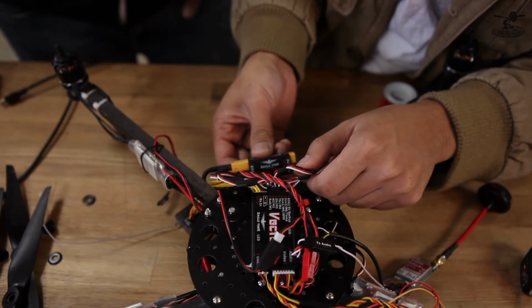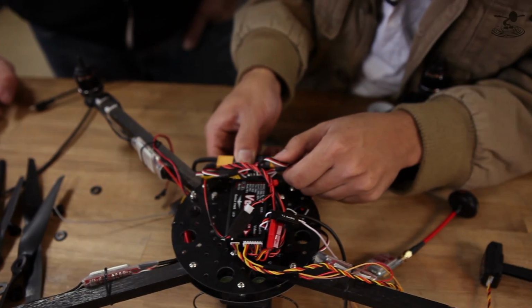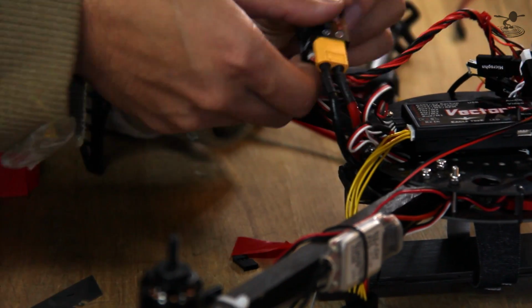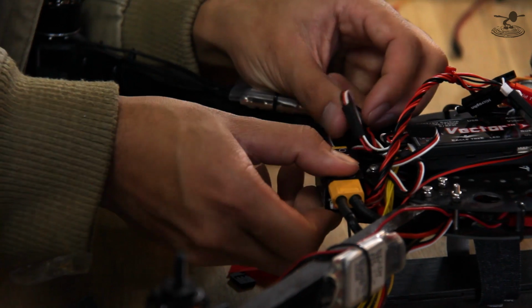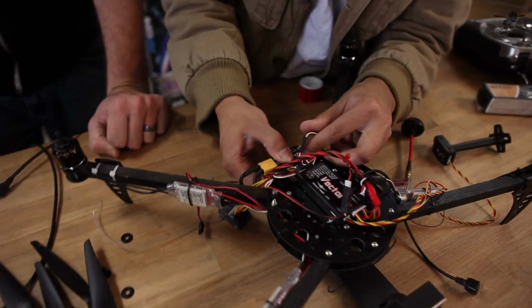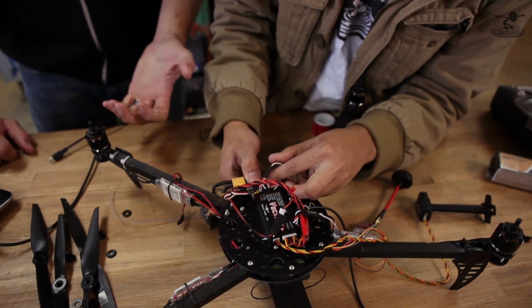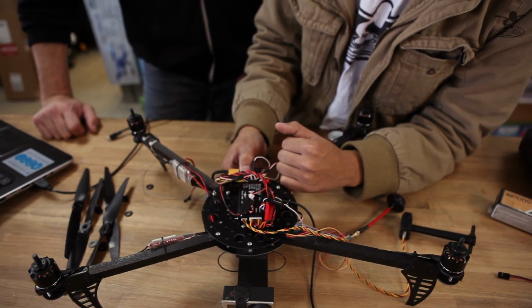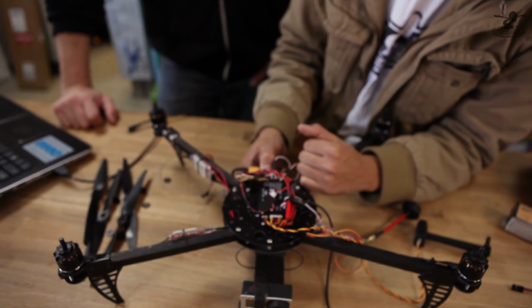We want it to easily be able to reach the battery too. Yeah, I'll probably just glue it right there. What would you think? I think that's great. Cool. But the main thing about this is it's in open air, so it's not insulated within some really tight confines. You'd want to be worried if you're, say, flying an aircraft where it's inside the fuselage. Yeah, and you're pulling lots of amps too. Then you definitely want to have some airflow over this. Otherwise, you're just asking for it.